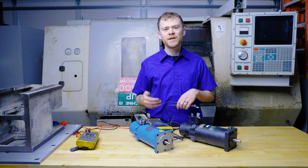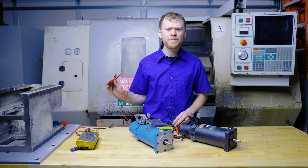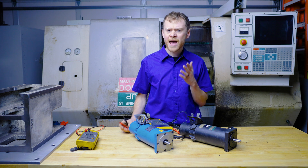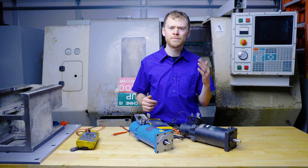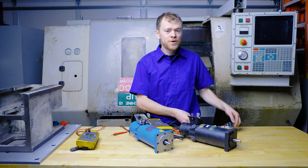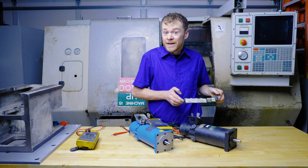So if you're measuring in the back of your machine and you measure anything bad with your own ohm meter, you have to test it with a megger. If it measures bad with a megger from the cable, you have to separate the motor from the cable — meg the cable and meg the motor independently. You can run your machine at 1 meg to ground, but you might end up getting new motors and new amplifiers, so be careful.